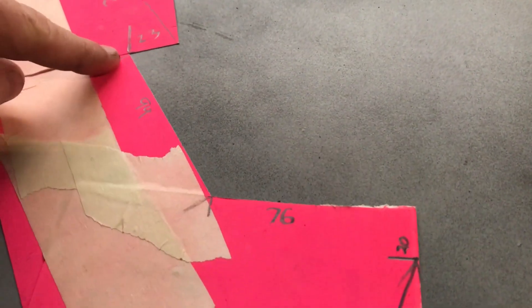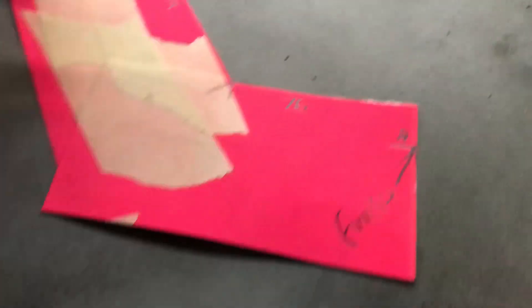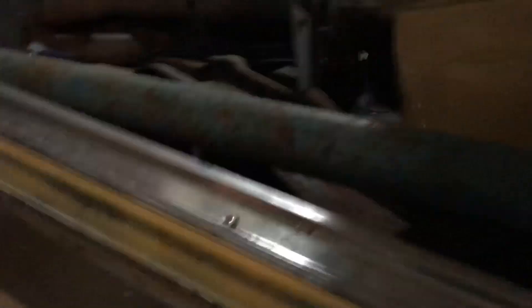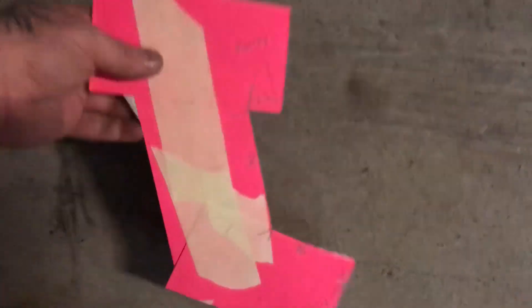This is the face of the sill - the part you see when you look at the side of the car - and that's the horizontal bit that goes underneath that you don't really see, and then there's a little 20mm lip where it's joined to the floor under the car. So that just fits over the sill like that. It's a lot easier to make these templates out of separate pieces taped together at the right angle than trying to determine exactly how to cut the angles perfectly without any gaps. That's why I use multiple pieces and a bit of tape.